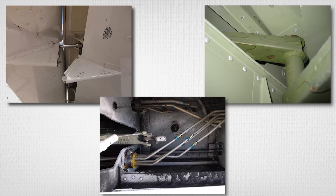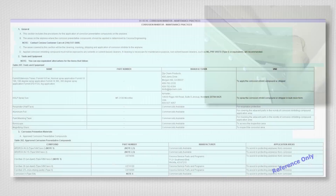Thoroughly rinse all components and airframe inside and out with fresh water. Dry all components and airframe. Apply corrosion inhibitive products — consult the applicable aircraft maintenance service manuals for approved products. Replace all bearings, including but not limited to roller, needle, and bushing type bearings.